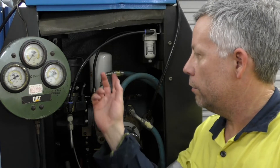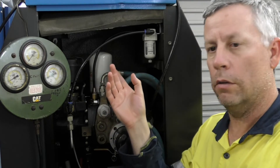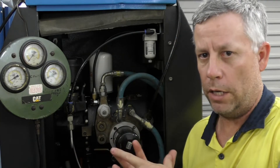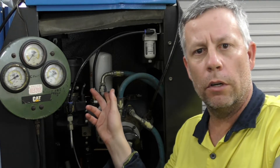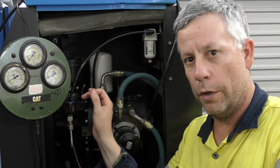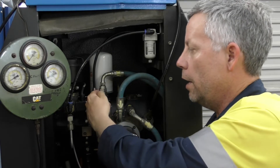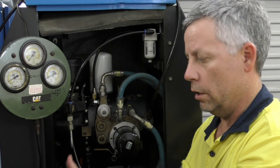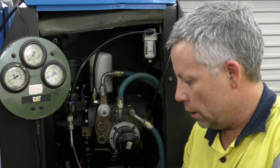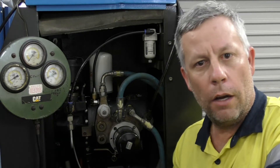So what's next? Do I increase the hose sizes, or do I also rehash the whole situation here - instead of going from here all the way down and then across and then all the way around the front and the side down to the back, shorten all the hoses up and make them larger diameter? I think I've got wiggle room in the hydraulic fittings because they are quite thick wall, and this only goes to nine bar - that's not much when it comes to a hydraulic fitting. So I could potentially go thinner wall fittings. I could go crazy and actually come out of here and put my own aftercooler on an angle so condensate flows to the bottom where I could have a drain, and then just make a more direct route from here straight to the receiver rather than going halfway around Australia to get there.